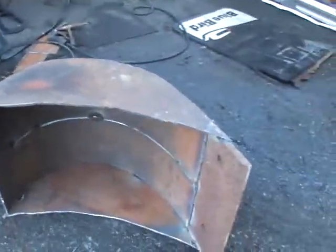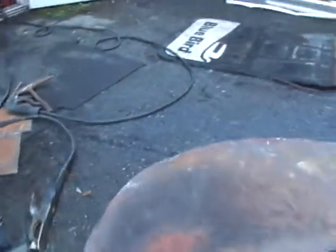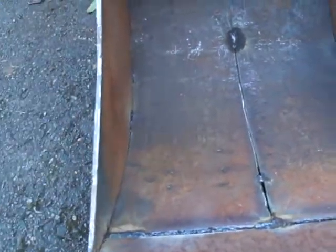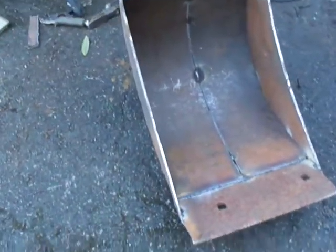The back looks like that — I'll leave those holes there, they don't bother me. The curve isn't fully matched yet; I'll trim and fix it. This is the first stage of my service bucket. I designed it with tapered material: the back is 15 and a half inches finished, and the front cutting width is 15 inches, so there's a cutting edge on both sides rather than against the bucket. This will make the bucket last longer and reduce friction between the trench and the bucket.